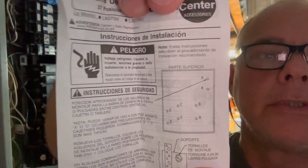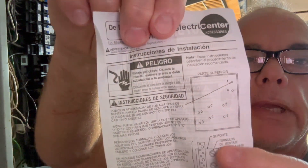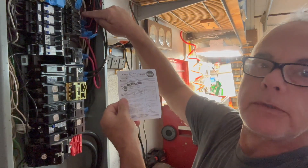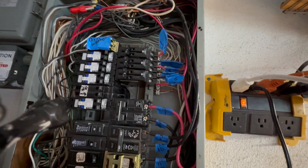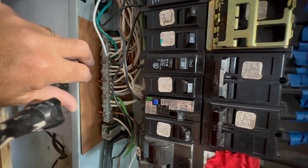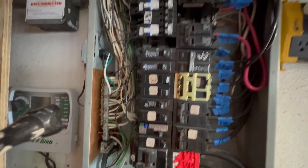The diagram on the other side shows you where you can place it. I have mine up here, but your panel may have holes here, here, or here. We have an available spot up here where we're going to put the new bus bar. What I'm doing is taking all these hot conductors off — I have them numbered so I can get those out of the way. Then I have to take all the neutrals off to get to the grounds. The grounds are back there. This is an insulated bus bar here; the ground bus bar is not insulated. I have to pull all these neutral wires out to get to the ground wires, and then I'll put them all back in.